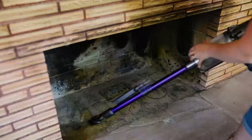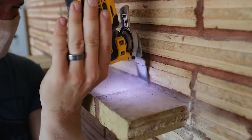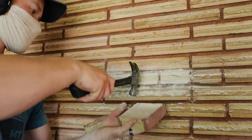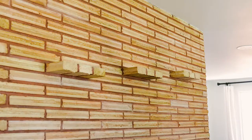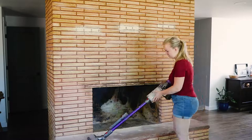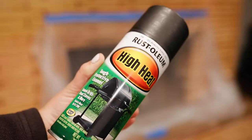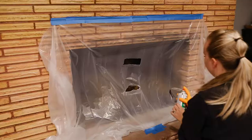To start the process, we wanted to remove these bricks. The brick has a very specific break pattern, so Joel tried to imitate that as much as possible when he cut them off — and he actually matched it pretty good, I was impressed. Then I had to vacuum up all the debris because it got everywhere. It was sitting on the ledges of the stone, so I wanted to make sure I cleaned that off really well. Then I took this heat-resistant spray paint and sprayed the inside of the firebox — I vacuumed it really well first, but other than that I just sprayed it because I wanted it all the same color, and it actually worked out pretty well.